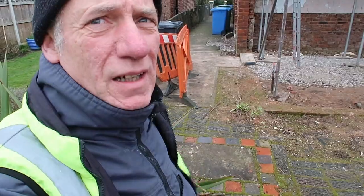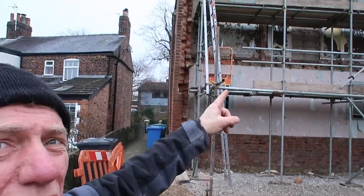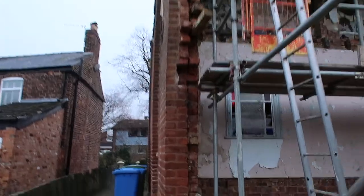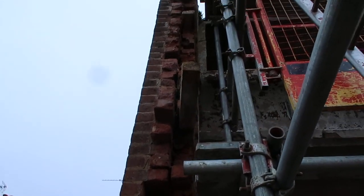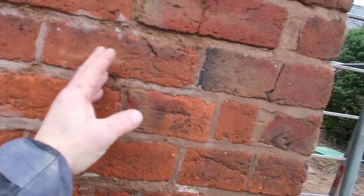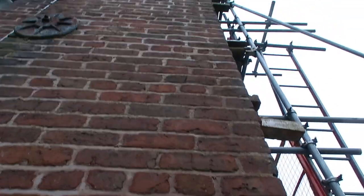It's all been underpinned up there and now I am going to start knocking off this plaster. These are the pillars — we've got to set them back, cut them back down here. They're sticking out too far, so we'll cut it back and smarten the pillars up, as you can see up here, and the same on the other side.